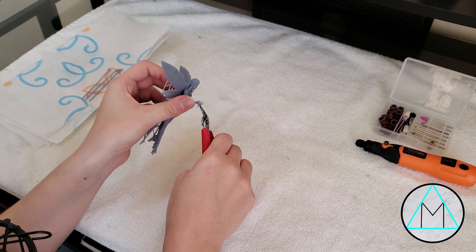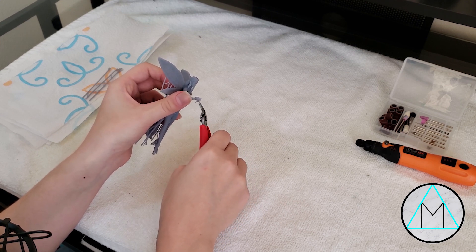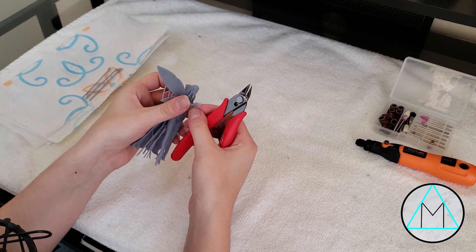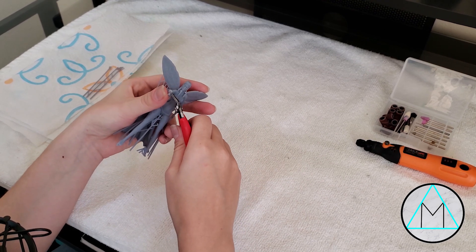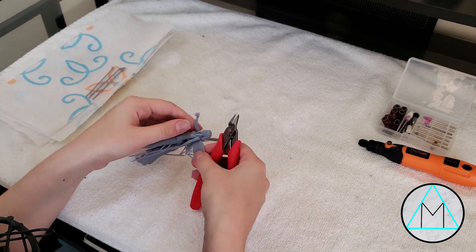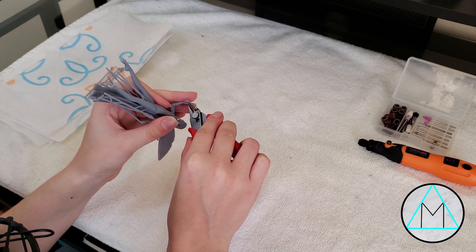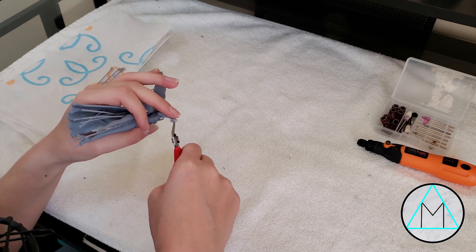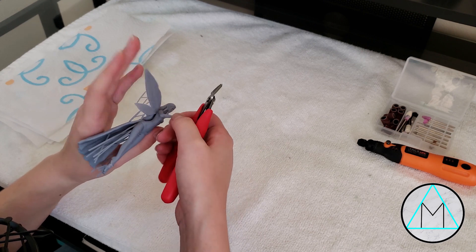These are kind of wrapped around your hand — your snips, really small clips. If you can actually break the support in the middle before you clip the whole thing, sometimes that will release the amount of tension on the break. Another thing you can do to make this easier is when you're adding your supports — I use Meshmixer for this — you can make the tip diameter a little bit smaller. I want to say mine is like 0.1 millimeters. If you want to see what profile I use, just let me know and I can do a little video on that or put it in the description.